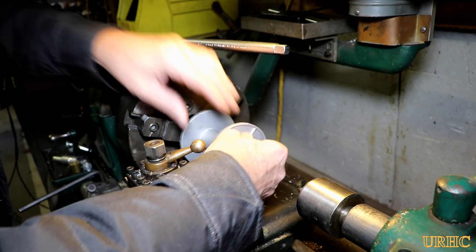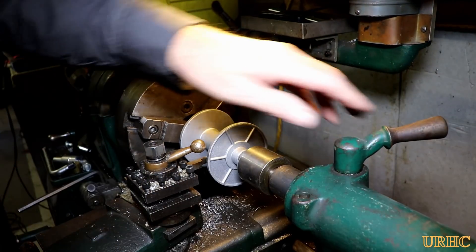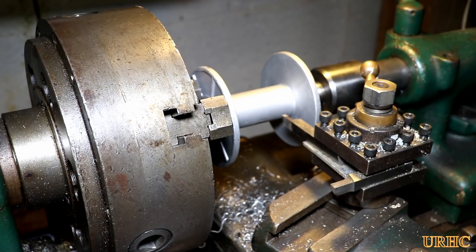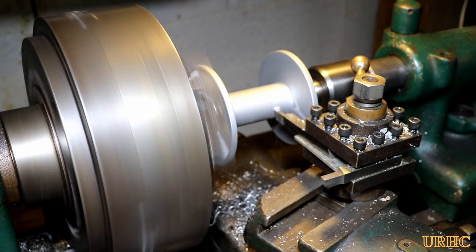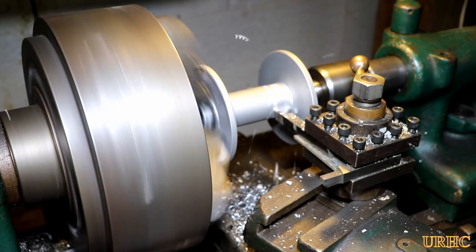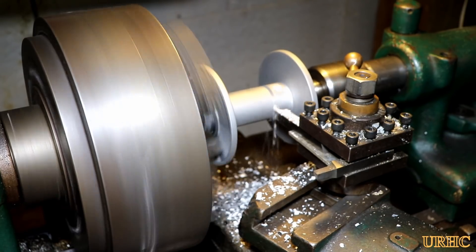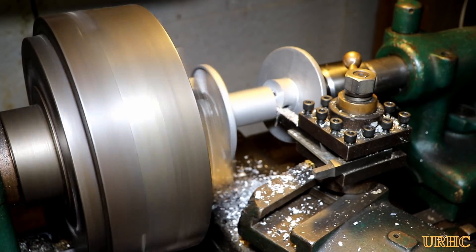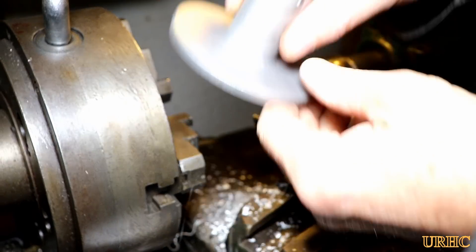It's going to be a fun job to modify this, because I've wanted to use these for some other projects too, so I decided to try one. First thing I did is I took that spool and mounted it in my old South Bend lathe and decided to try to cut it down to a proper length for what I'm going to be doing with it. Inside there's a pocket with four little things that center that gear, and they also hold a spring in there — I'll show you that a little later. I started cutting it off, making sure I left enough room for the stub of the shaft and also for the spring to hold the gear in place. I used a cut-off tool and let the lathe cut it off. It did kick out a little bit because it's really soft metal, so it's kind of hard to grab in the lathe.